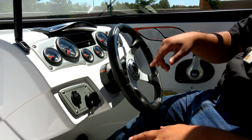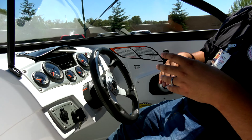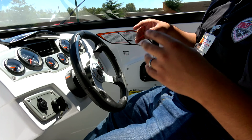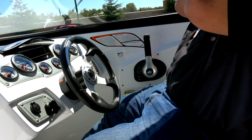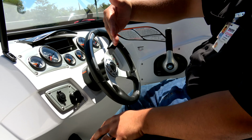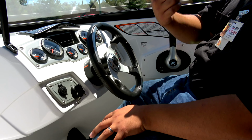Now before going on the water, yes, you can do it. The drive on this one is a little bit different than a regular outboard, so you can run that rubber impeller a little bit longer, like a couple seconds or so. Once you hear it start, you're good to go. So I should dip it into the water first, then start it? This is when you're at home. Before you go out on your trip, you want to check your motor and make sure it starts, so you don't have a dead battery on the launch ramp.